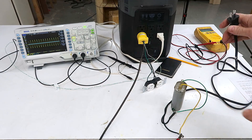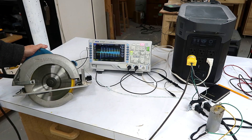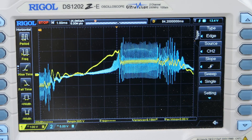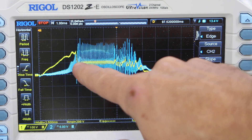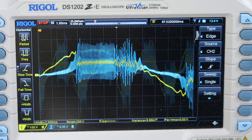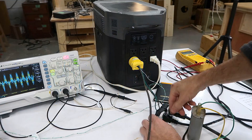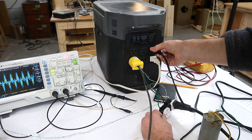Now, the question is, can we filter out some of these oscillations? I'll connect this 25 microfarad motor condenser in parallel. That makes the voltage swings not oscillate nearly as much, although we're actually seeing quite a bit of oscillation on the current — not surprising, because the current is going into the capacitor. Let's switch that cap to be plugged directly into the EcoFlow so we're not measuring its current.